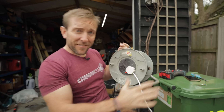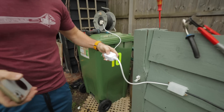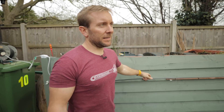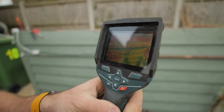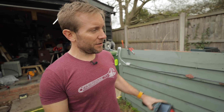We've plugged this in — this is inside the house. I'm trying to give you the whole premise that you don't have to keep having pipes going wrong and breaking. Hit reset, do a test — that's holding, that's testing, that's holding. So we're all good there. I'll get my thermal camera out and prove it, because it's about 18 degrees out here at the moment so it shouldn't be coming on. And you'll be able to see on the thermal camera that it's not on right now — nothing there is ridiculously hot. Fortunately I've got a chest freezer, so we're going to shove this in there for about 10 to 15 minutes, then whip it out and hopefully it will have cut in.